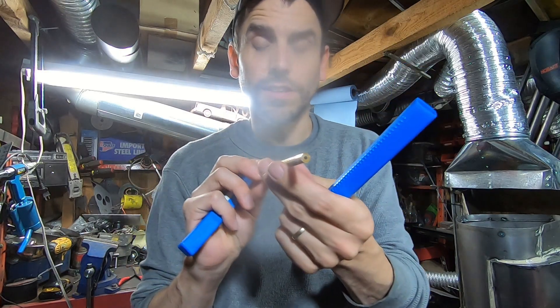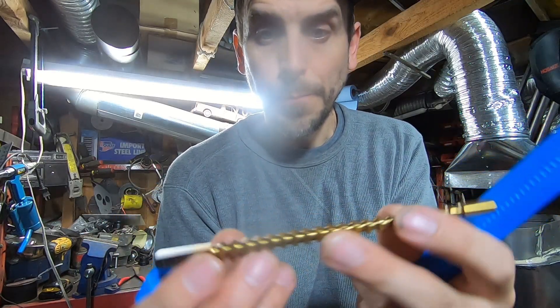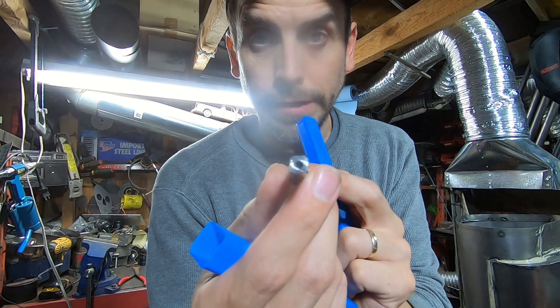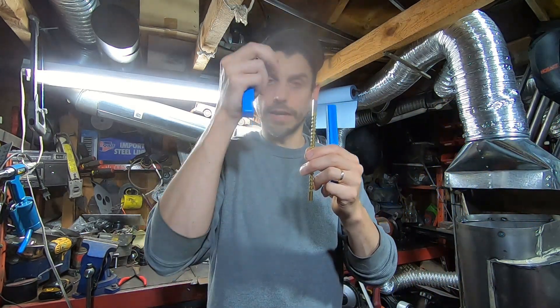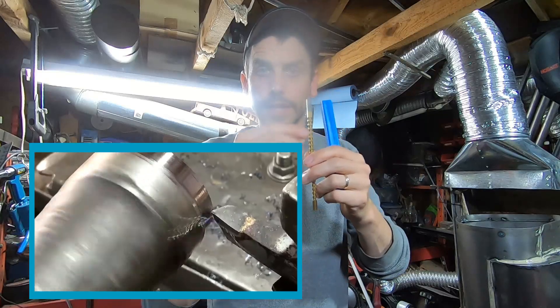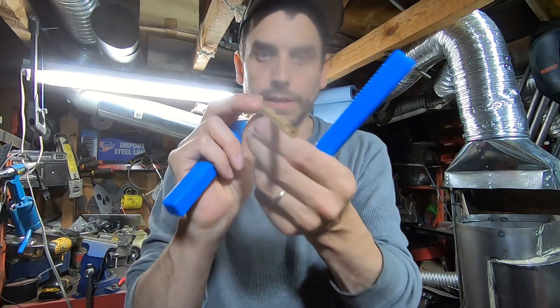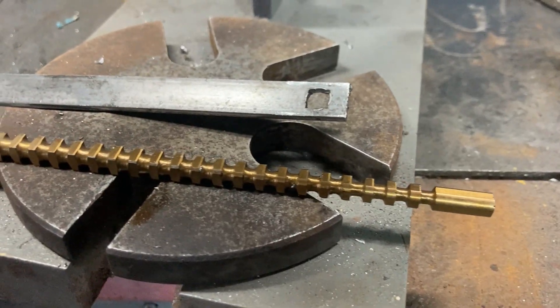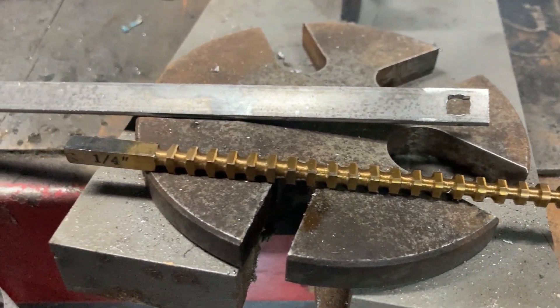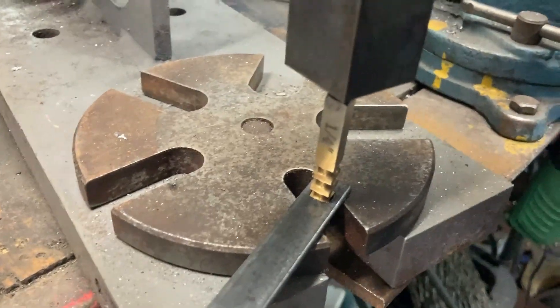No — and it's a shawl pin for a very elegant lady in about 1900. What this is, is a special cutting tool that starts round and finishes with a perfect quarter inch hole. Most cutting tools take a little bit off each pass. It's really hard to do that if you're trying to make a hole go from one shape to another. What this does is these teeth each go increasingly as it goes up. So all you have to do is push this through a hole and you're left with a perfectly square quarter inch hole.